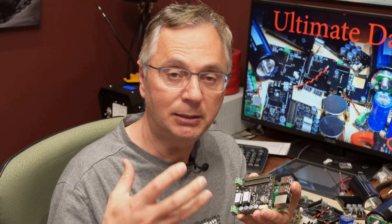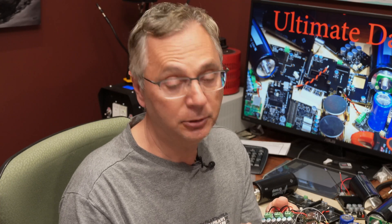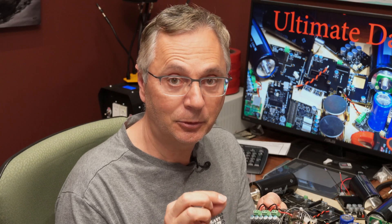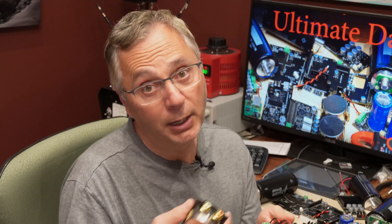We're recreating the digital stream into a much better, cleaner digital stream. After that we want to convert digital to analog, for which we're using a couple of digital-to-analog converters. We then send that small signal from the conversion into some transformers to make it a little bit louder, and from there we can send it to an amplifier to make the big sound and play it on our speakers. That's how we're converting this digital sound to analog sound and making it as clean and pure as possible.